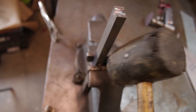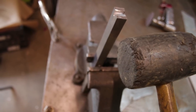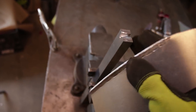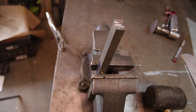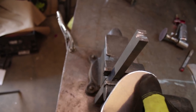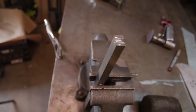I've been using this rubber mallet - super old, beat up. I use it for all kinds of stuff but it's gentle on the aluminum. It's only putting pressure on the spot that needs to bend. It's a little wobbly in the vise, probably way too tall, but it's working okay. The challenging part is going to be to go around the sharper corner. I might need to make at least one relief cut, but we'll see. I'm just going to keep going.